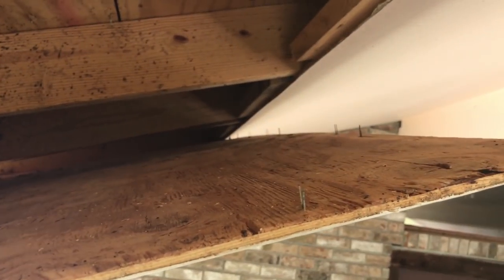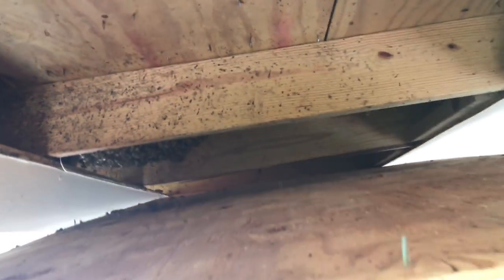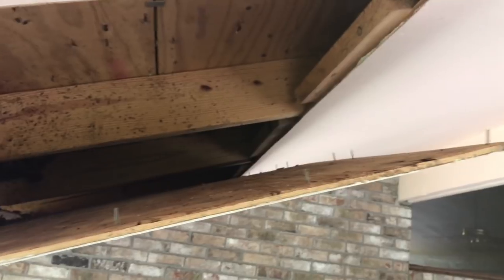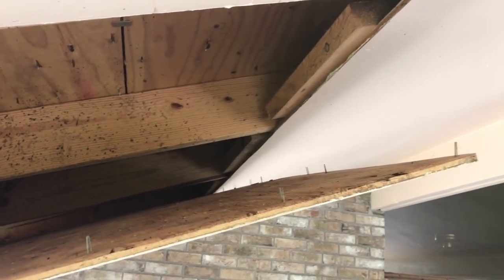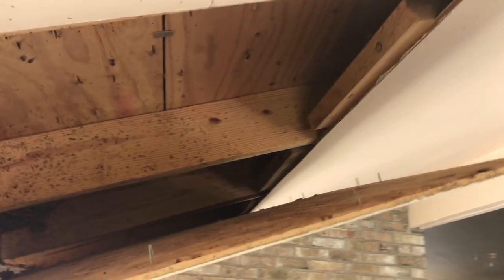No, I ain't gonna be able to let it hang. I gotta take it down. All these staples. I gotta cut all those staples flush with the board. They're all the way across the center. If I don't, that board won't go back up flush because those staples will fold over. I'll be trying to knock those things in flat, and I'll just beat the crap out of that panel with a hammer if I try that.